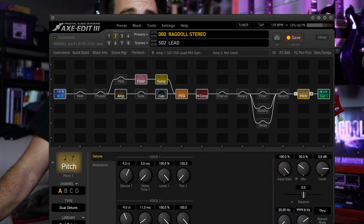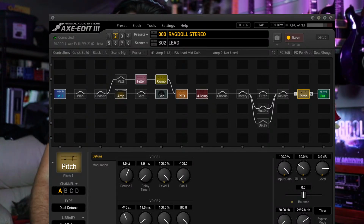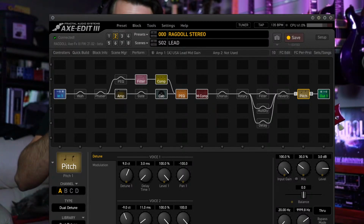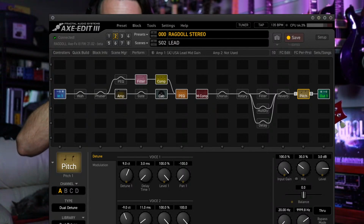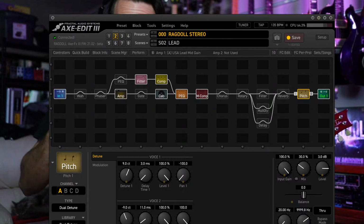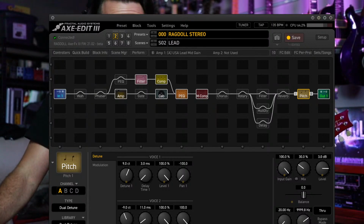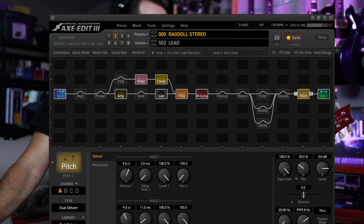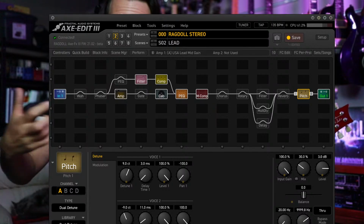But you can't change the way the pitch detector works, and the way a digital pitch shifter works, or the way the old ones work, is they would record a sample and change the pitch by kind of changing the playback speed, and then they would splice it together so you'd have an interpolation and crossfade in there. And if you listen to an old Eventide on patch 231, you can hear the whoop, whoop kind of little interpolations. But there's another pitch shift program on there called Dual Shift, which is a lot smoother. They use a different crossfade algorithm in there.